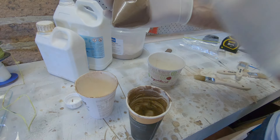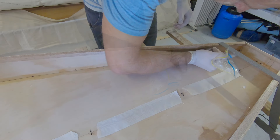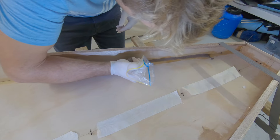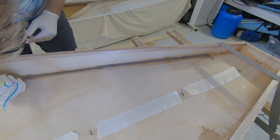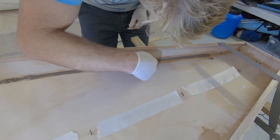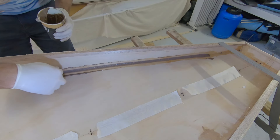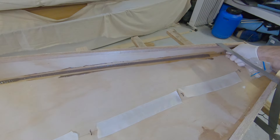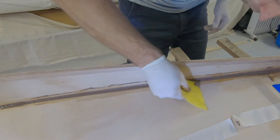Take the bag out, give it a twist, all the epoxy's down the bottom, cut the end off with some scissors — nice and sharp. Those scissors, by the way, are an old pair of Leatherman scissors passed down from my wife's grandfather, which is pretty cool. And here we go, just squeezing the epoxy into the corners. Don't do too much — just enough to get a radius of around 10mm into that corner. I'm using a bit of cut plastic with a radius cut on the bottom edge, making those epoxy fillets in the corner. There's a bit of extra on the top and side of the fillet; I'll go back and clean that up with a bit of board. Nice, clean joints, no excess epoxy.